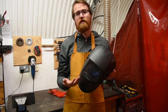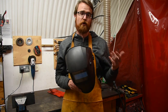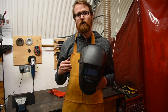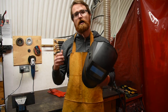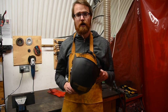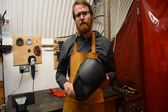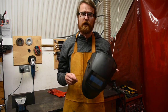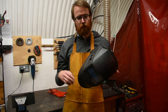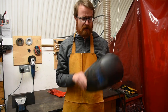The darkening level allows you to protect your eyes and avoid eye fatigue, but also to see the weld pool as you're welding so you can manipulate it and see what you're doing. This is something that feels a bit foreign before you give it a try, but once you get used to welding and understanding how to manipulate the torch — advancing it and moving that weld pool through the material — being able to see is a very important part of that. These helmets help us do that safely.